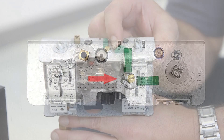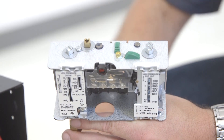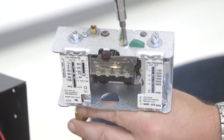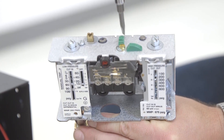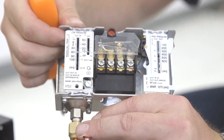When moved to this position, both pressures are set for manual reset. In this case, we want the high pressure side set to manual reset to function as a safety switch, and we want the low pressure side to be automatic. We're running a condensing unit with a pump down cycle, and when it hits low pressure, we want the compressor to shut off. Once the pressure starts to rise, we want it to cut back in automatically. To do that, rotate the cam clockwise, forcing the manual depressor to stay back. Now it's going to operate in automatic mode, so we can move the contact mechanism up and down freely. Our low pressure is automatic and our high pressure is manual.